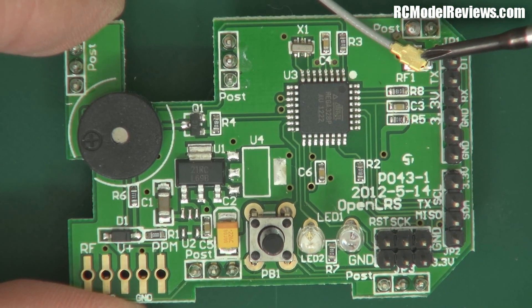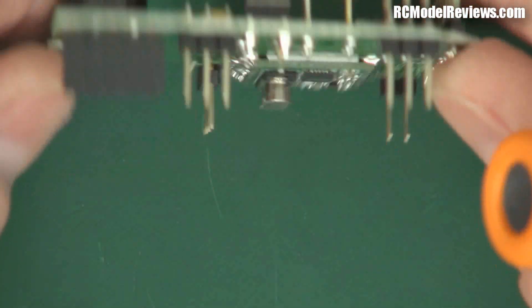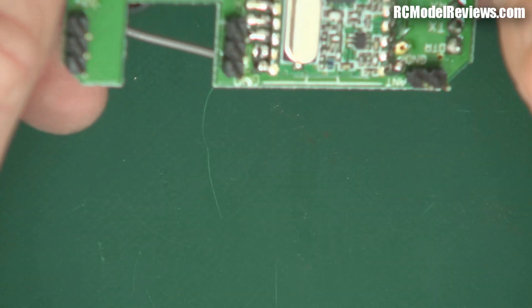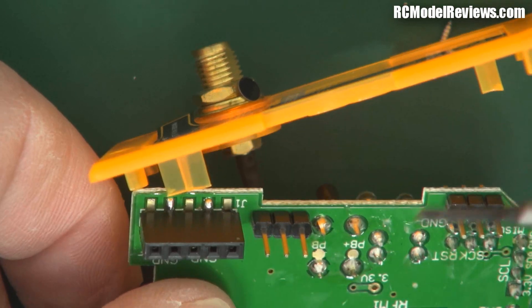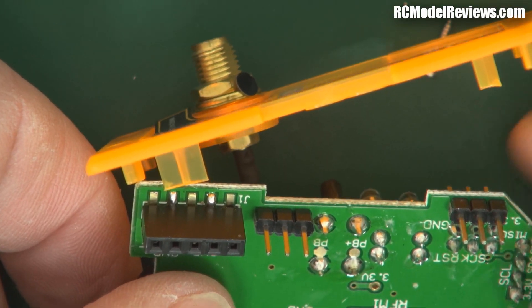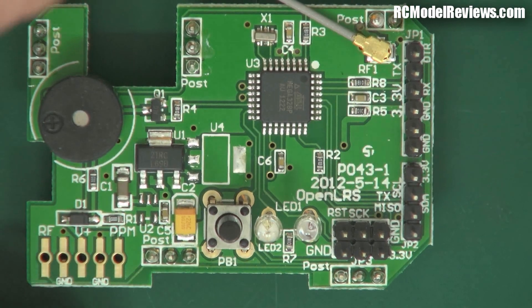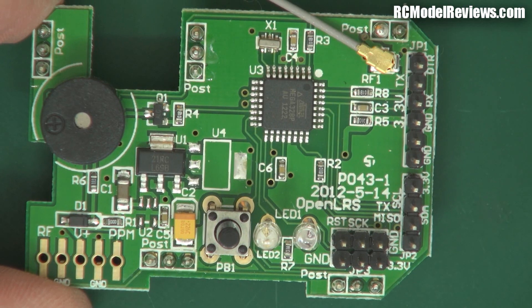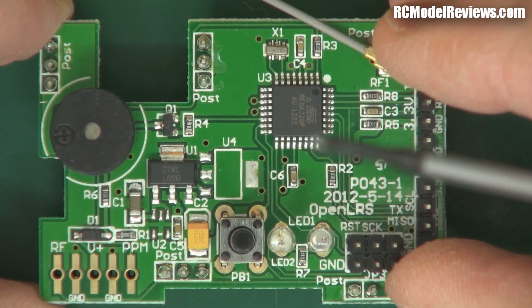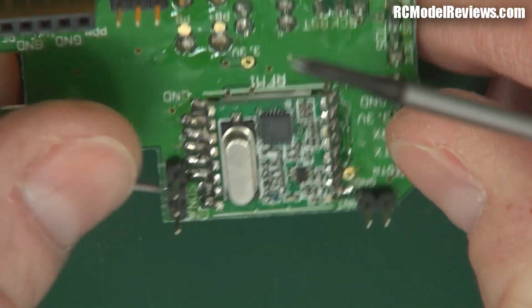These pins — sorry, those must be for programming. The module pins are on the other side — there they are — the connectors going to the back of your transmitter. There are other pins for programming and other purposes. Construction-wise, it's not a bad piece of board. It's got green solder mask so you can see what's happening, the soldering is good, and the layout seems reasonably good. Nothing to grizzle about there.